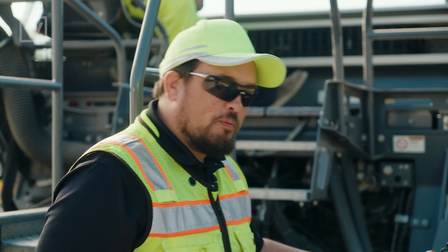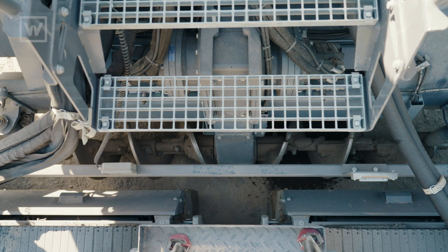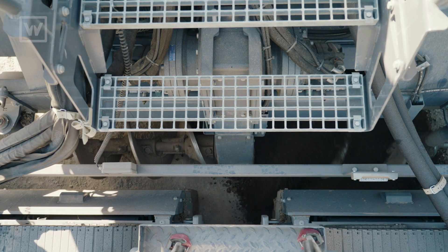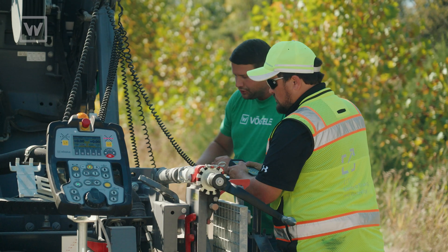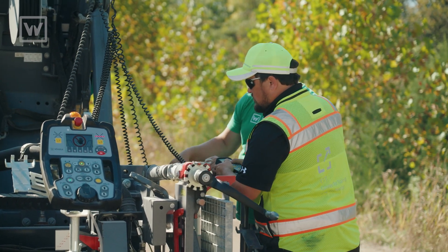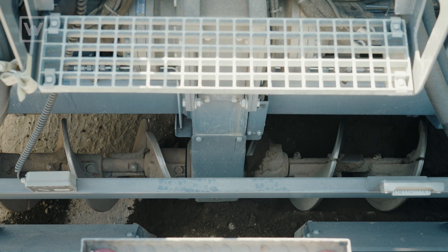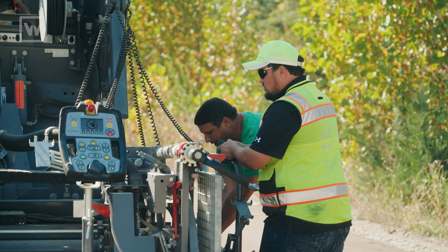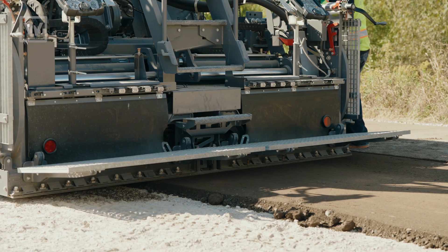Great, that's the tips and tricks I was looking for. Grab your remote. All we're doing is short feeding the conveyors to just keep the augers fed, because you want to keep that center empty — you're only paving with half the screed. You see they're speeding up a little bit, so feed a little more. We can actually change our sensor a little bit to the front. There you go, you're getting it now.